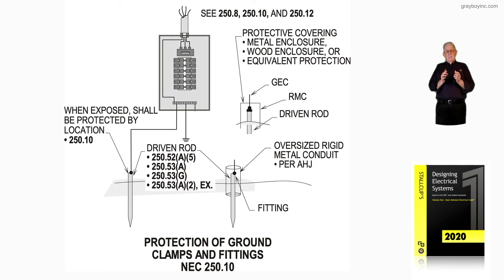To make sure the driven rod provides any of those functions, NEC 250.10 says that termination has to be protected. One way they do it out in the oil patch is to drive down an oversized metal conduit or Schedule 80 IMC, cut at an angle, drive it down, and drill holes in the side. The electrician can then look into that pipe, see the connection is made, and confirm it's connected properly. If you're going to leave the rod above grade, you're supposed to get a longer rod.